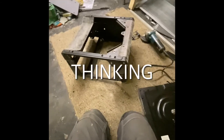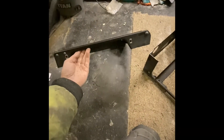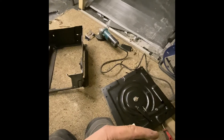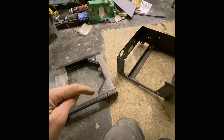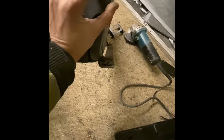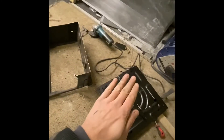I've had a change of plan. That perfectly fits the underneath of the seat because it was designed and made for it. So instead of making brackets to fit the rails of the seat that would normally go onto that, I am going to make that fit by bracketing up the underneath of it, and then it will sit inside this recess. I'm going to cut about 20mm off this, bracket it up, and sit the plate on top.